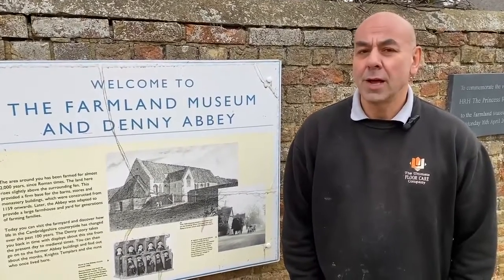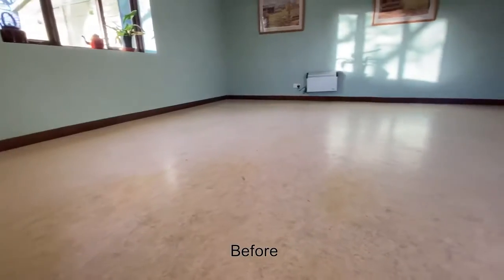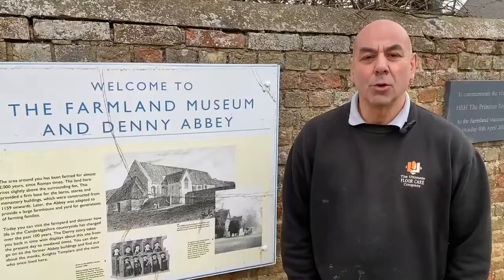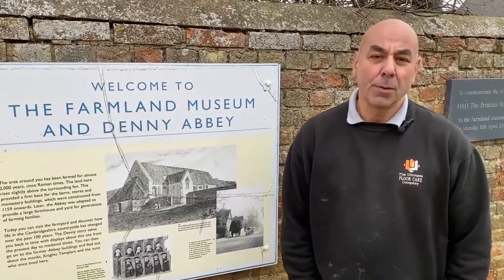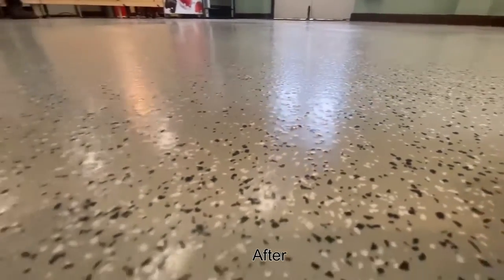And yeah, so we'll have a look at the pictures underneath that will give you a better explanation of what they do. In this particular case, the vinyl, we used a 50 grit poly brush. We just found it gave a little bit more bite into the vinyl, cleaned it up a little bit better. So here we used a 50 grit poly brush, and that is recommended by them under their vinyl and LVT